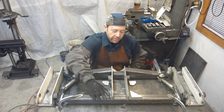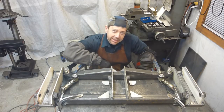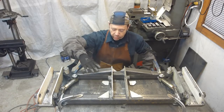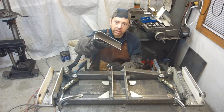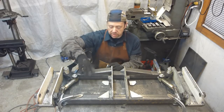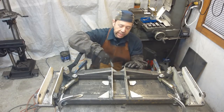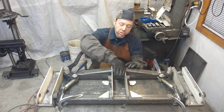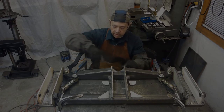Okay, we added, after a long discussion with Dave, who is just behind the camera by the way, many gussets and reinforcements we can put. So there will be here, this is a 2x2 cut in half with an angle that will sit like there, small pieces in the middle. And by the way, we can't cross there, just because the curl cylinder in the retracted position fits right in that position. That's why we have to do small gussets there.